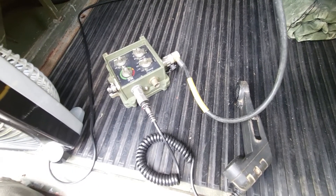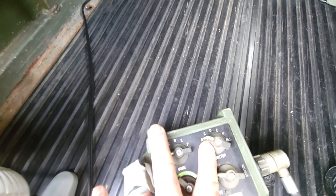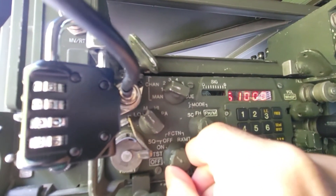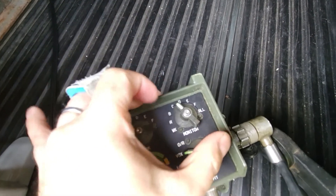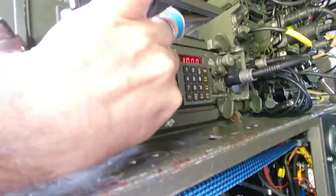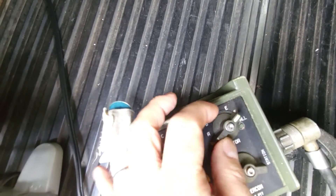This back station is now connected. Turn it up nice and loud — right now it's monitoring radio B, which has nothing connected, but we've got the SINCGARS as radio C, so let's switch to C. With squelch off you can hear the noise from the handset. Switch squelch on and the noise goes away. Switch it back off and you hear it again. You could also select D, E, F — nothing's happening on those — or you can say 'monitor all,' and it will literally monitor all radios that are receiving traffic.